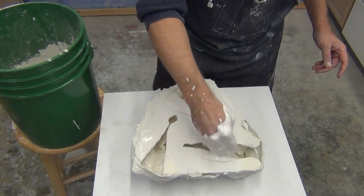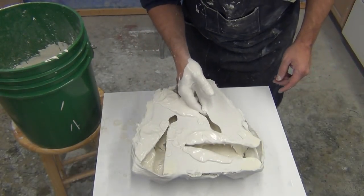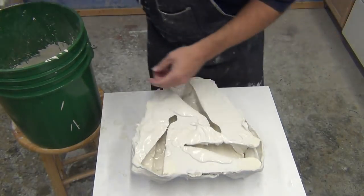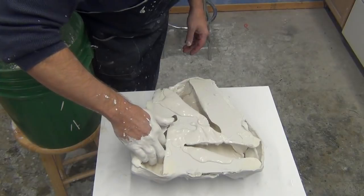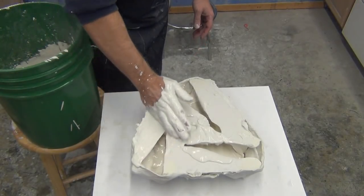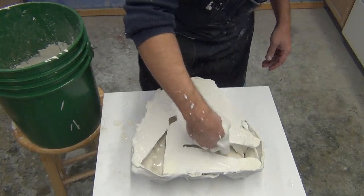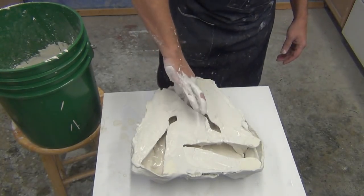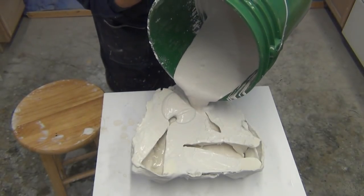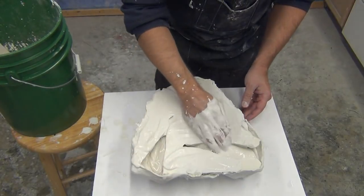For casting material in this type of mold, the two I'd recommend are Hydrocal or Hydrostone — both work great for hand casting. Hydrostone is the stronger of the two, but we've gone with Hydrocal because Hydrocal goes through a more workable intermediate state as it sets up, allowing me to stick my hand down into the cast and work it up into the fingertips to make sure there are no air bubbles. Hydrostone, while much stronger, goes quickly from liquid to a very tough solid and is harder to clean up, making it better suited for art casting where there's minimal cleanup.